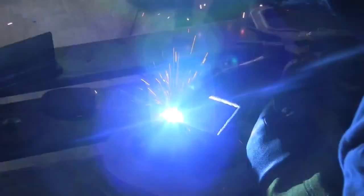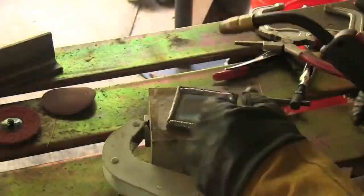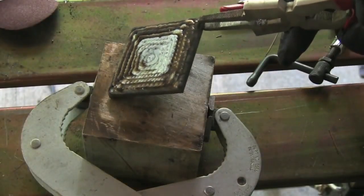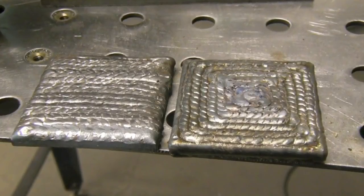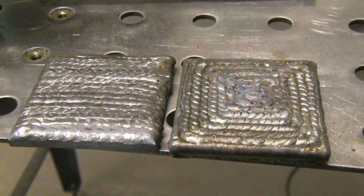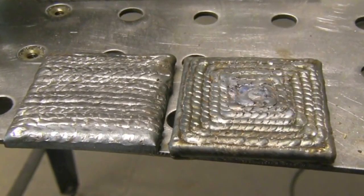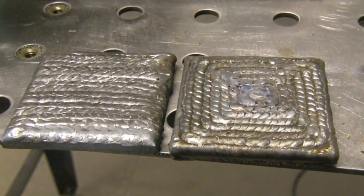Another option, another version of this drill, is just start on the outside and then kind of turn it as you go, kind of back step weld, kind of tie into the previous start, and then you fill it up like that. So there's two versions of the padded bead there, both good, both a lot of practice with very little bit of cleaning or prep or anything involved. You just get a lot of seat time.